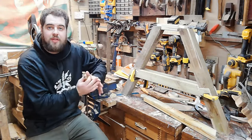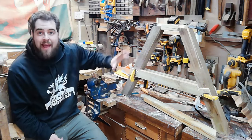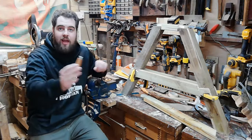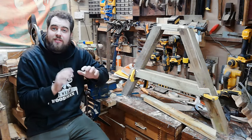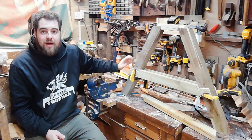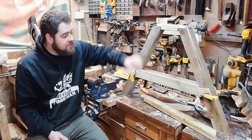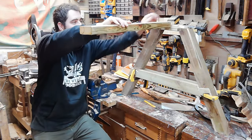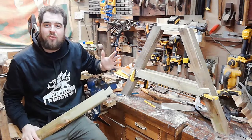Before we start cutting the joints to put this all together, I've done a little dry run — I've clamped them into place to make sure I'm happy with where everything goes, and I've also gone around the joints with a marking knife. That's going to help me when I come to do my chiseling, giving a registering point for the chisel to sit in. We're going to unclamp this now and start cutting these cross braces. I've already jumped ahead and cut out another dovetail for the top where the sloped leg comes off to make that tripod.